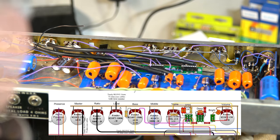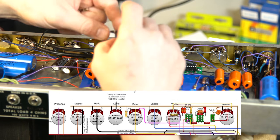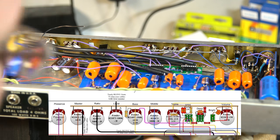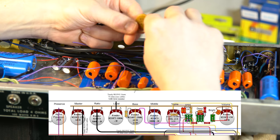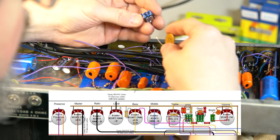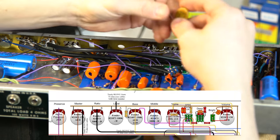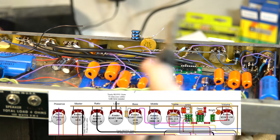I need to get a 1 meg resistor. Let me double-check the measurement with the volt-ohmmeter — grabbing from a bin that could have the wrong value accidentally. 9.93 — yep, we're good. I think what I'll do to make this easier: connect the resistor between the two leads and solder them together on the capacitor, since that's how they're supposed to work. Then I can easily put one lead through the top and around to the bottom and across.